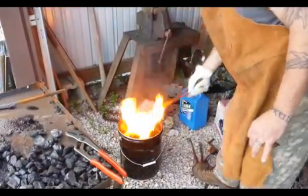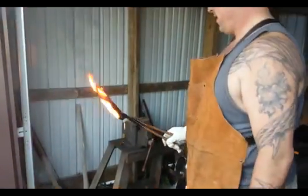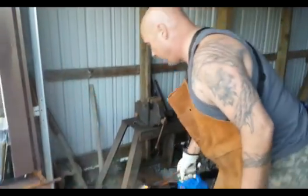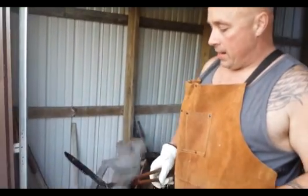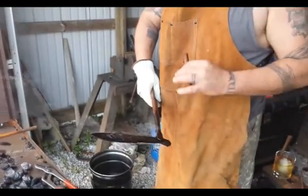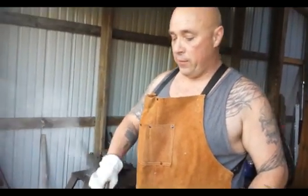That's perfect. Here we go. Knife's cooling down now, it's quenched. Should be good and hard. It's got a nice bit of scale on it — I'll take care of that with some sandpaper and some final grinding. Hone the edge on it, put the scales on it. Then I'll start building a custom kydex sheath for this.